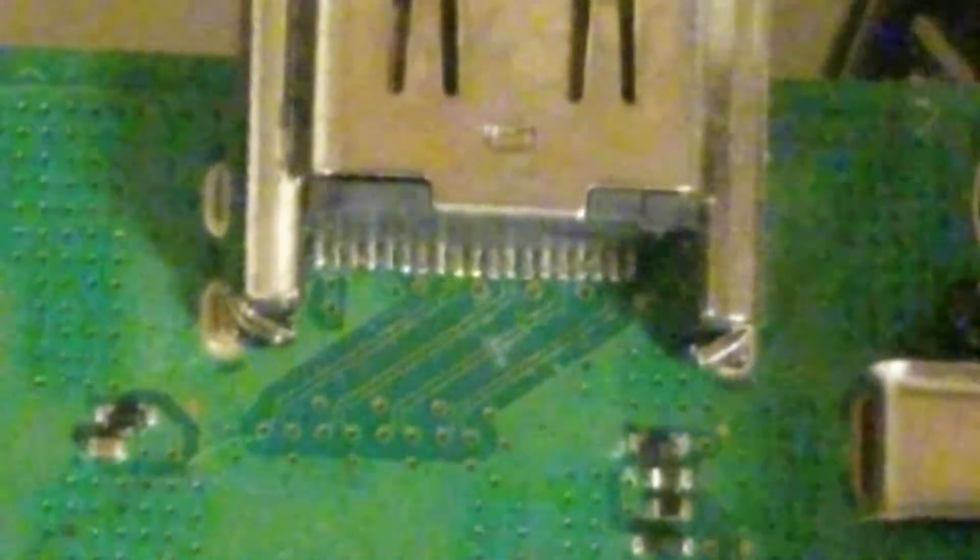Okay, now we're going to take a multimeter and we're going to put it in diode test mode. The reason why diodes need the test mode, if you don't know, is that diodes only go in one direction, so you need to be able to test which is the anode and cathode on a diode. Which basically lets us tell if we get a beep, it means electricity is able to go from point A to point B. So what we're going to do is stick one end in the HDMI port contacts, and we're going to test the other side on the alternate points in the back. Which actually, give me 1 second, I actually need to grab my alternate list of points.